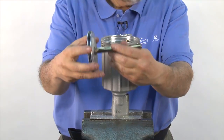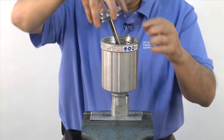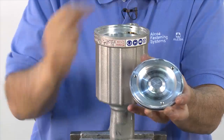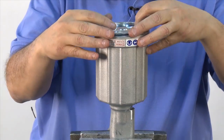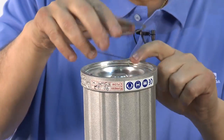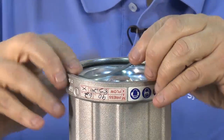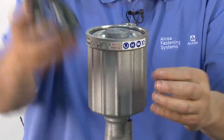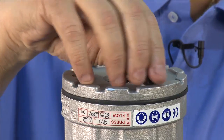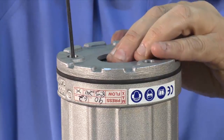At this point, bring the air piston rod in. Lightly lubricate the piston rod and seals, then push the rod in. Install the back cap, lining up one of the holes with the indicated spot. Use the brass hammer to make sure it is bottomed out. Take the spiral lock ring and walk it into the groove — be extra careful to ensure it's properly installed. Now insert the muffler and back cap with the rubber gasket and insert the screws using an Allen wrench. Manipulate the muffler to ensure proper alignment in the back cap.